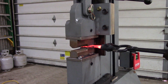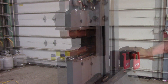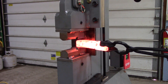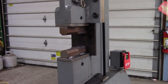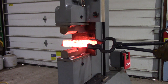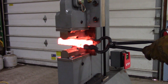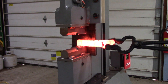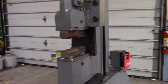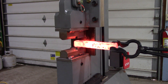In the end it winds up being about six inches long. It had some cracks at the end because if you weren't careful and squished it too hard, it would crack. So I was a little more careful with the larger piece — didn't overdo it right away, was gentler with it, kind of like when you're setting welds. That made me think I may not have gotten hot enough or long enough during the main weld in the canister, or maybe not enough pressure. But if I was careful with the pressure and didn't over-squish it too quickly, it seemed to consolidate down and get firmer as I went.